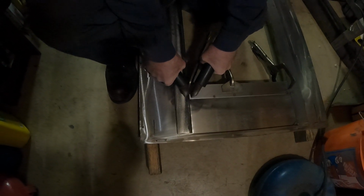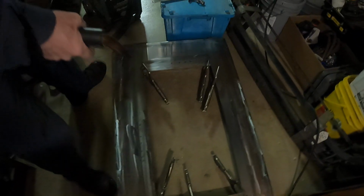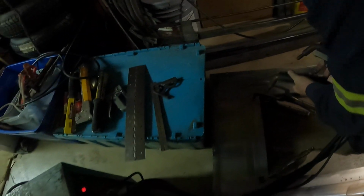And on this side. As you can see, it welded the two pieces of metal together right in the middle where the seam was, because the electric current was flowing through that way too. As the current goes everywhere when you do spot welding. That's to keep the spots kind of close together. The current goes everywhere.